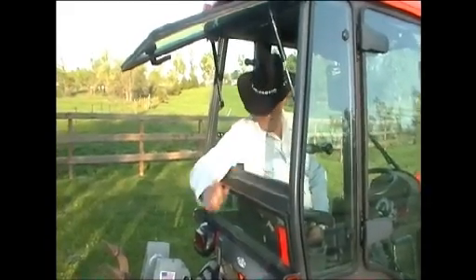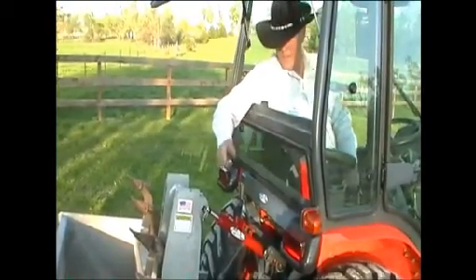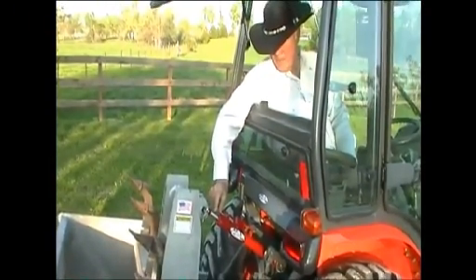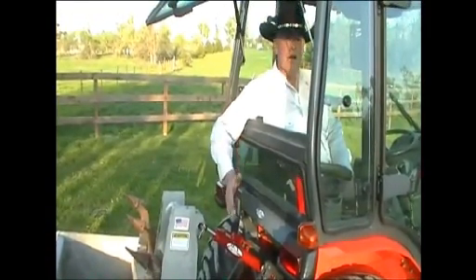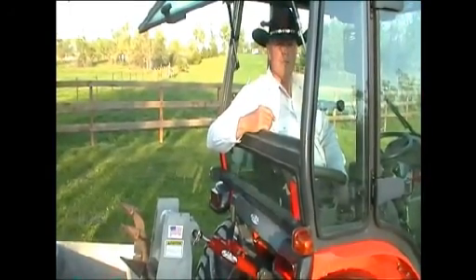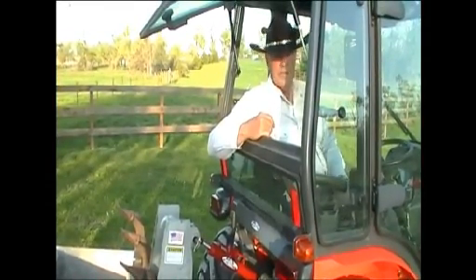The first thing I'm going to do is reach back here and make that adjustment that everybody wants to make, and now we're ready to go to work. You'll notice while we're working HydroLink that the ram will be moving just a little bit — about a half to three quarters of an inch the whole time we're working it. That is an air cushion built into HydroLink, and that will keep your back from hurting at the end of the day. It's easier on your tractor and easier on your implement. So, let's try it.